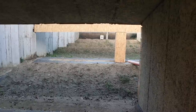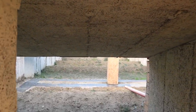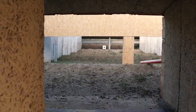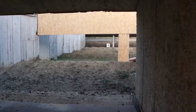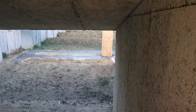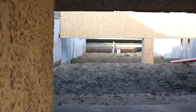Now that we're back in the shooting booth, let's see what this means. Basically, from the shooting point, no matter where the gun is pointed, the bullet must remain inside the range, and this must be true for any point inside the shooting bay. In other words, no matter your position, you must never see the sky. So let's pretend that the camera is the gun, and I'm moving it around the perimeter of the shooting bay. As you can see, no matter the position, you can never see the sky. The view is limited either by the walls of the range, the ground, the roof — which is purposely extending in the direction of firing — or by that baffle, which really deserves a closer look.